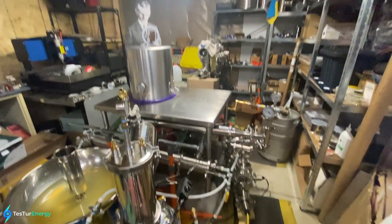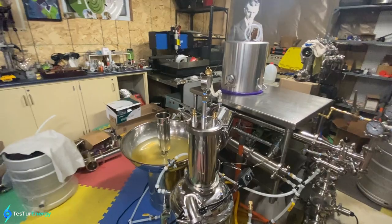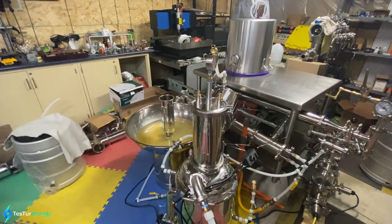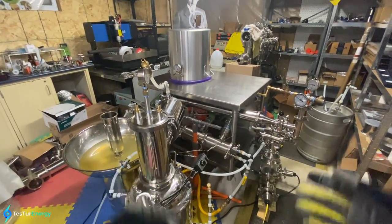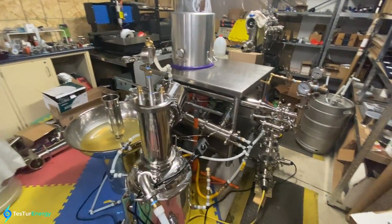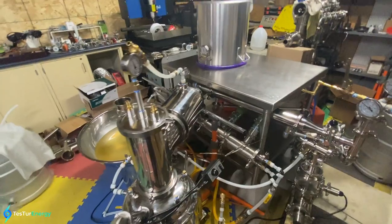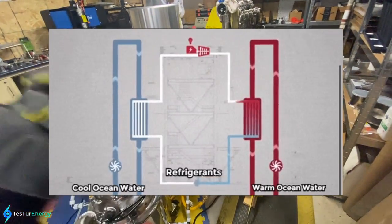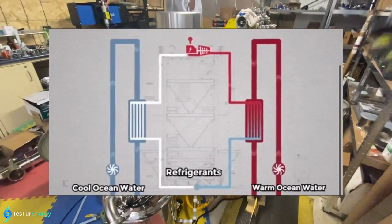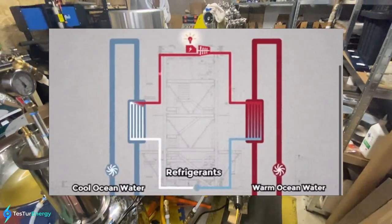You have electricity you pay for and you don't want to pay for it — electricity is getting expensive. This system is a way for us to utilize solar, geothermal, biomass, and waste heat that's being dumped out by fossil industries. There are also vacuum steam systems — cryophorus, cold steam — and if you're not familiar with ocean thermal energy conversion systems, they use the exact same concept. A lot of them use an organic Rankine cycle, where you change the motive fluid to a refrigerant, giving higher pressures at lower temperatures and higher turbine efficiency.